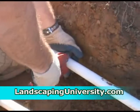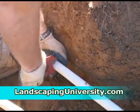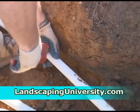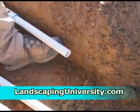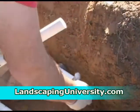This is what's going to our main water line. Once you've got it taped and tightened, we're just going to glue those fittings right onto the schedule 40 PVC.